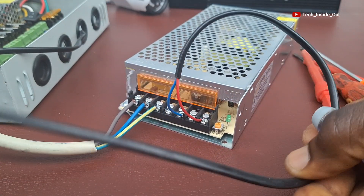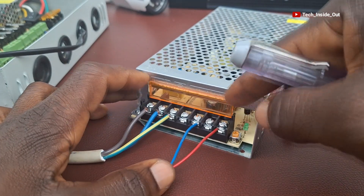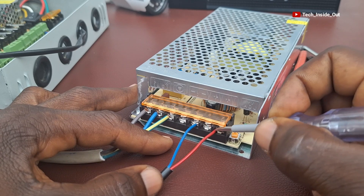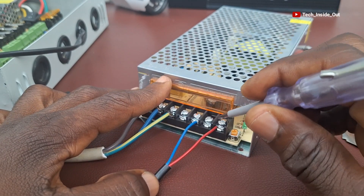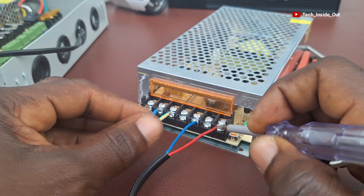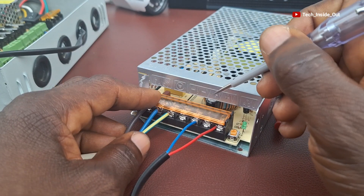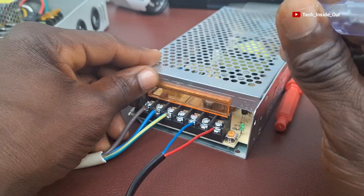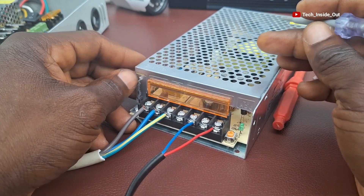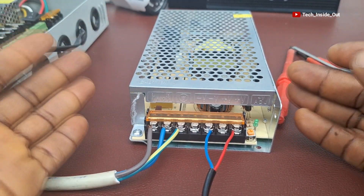There's also a V negative here — the third block — and you can put it under this one then tighten it up. This means this connection can go to a camera. Remember, because this power supply leaves it to your discretion, you can pair many other cameras on this same point. A positive can be added here, and you can have as many as five cameras sitting on this one block. All the positives come here and all the negatives come here. You also have another set of V positive and V negative which you can utilize for another batch of cameras connected to those two points.